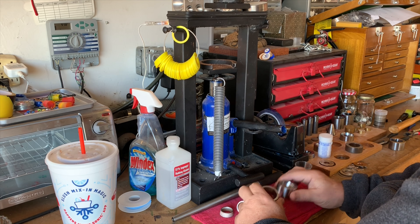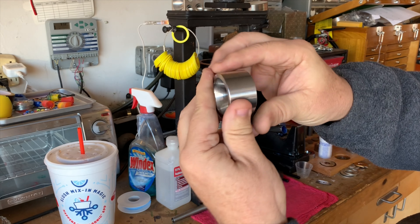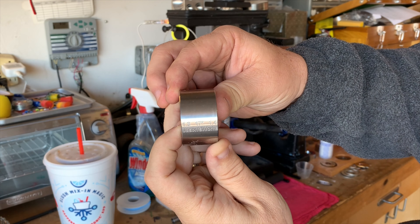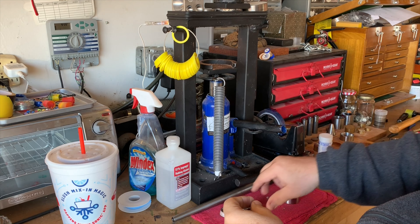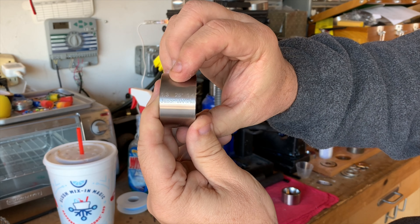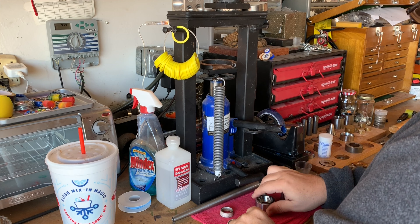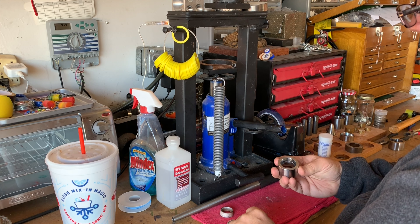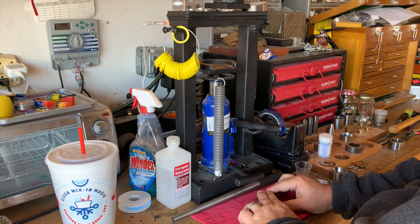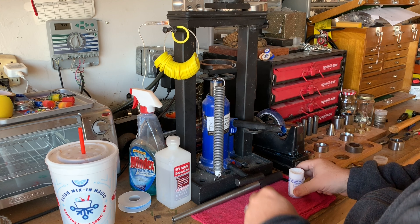I'm super close. I'm going to finish up with dies. This is my standard Jason's Works die — the standard dies come with a slope to the inner wall of 17 degrees. I also have a special Jason's Works die with a 25-degree slope to the inner walls, which allows me to put more fat tire into the ring without obliterating the side detail. I'm going to begin with the 17-degree die. It fits the coin very nicely, and whenever I'm doing this — lots and lots of Pepe Lube.